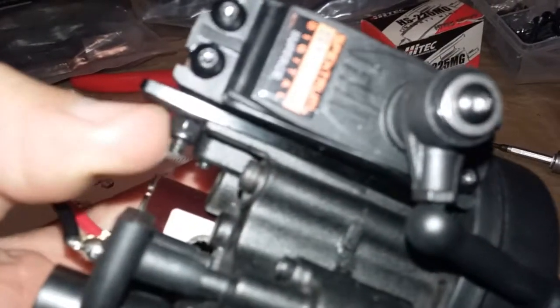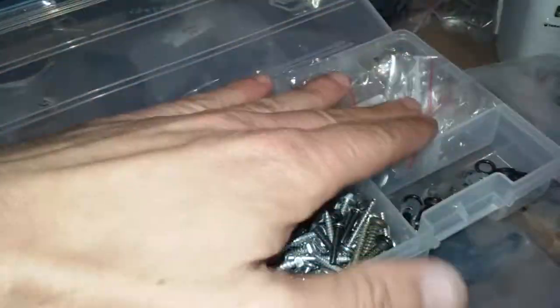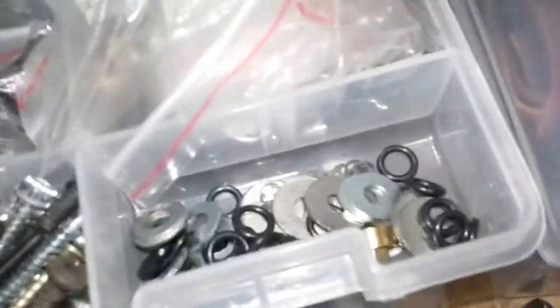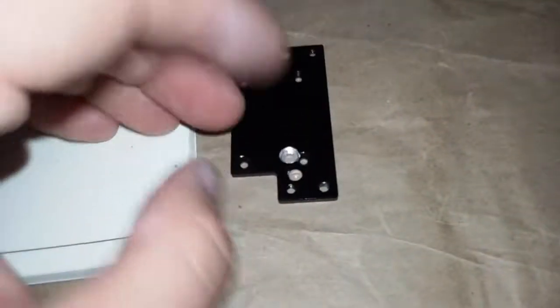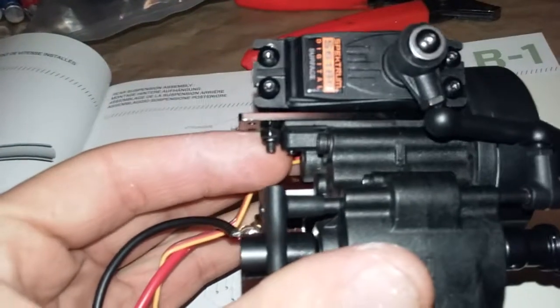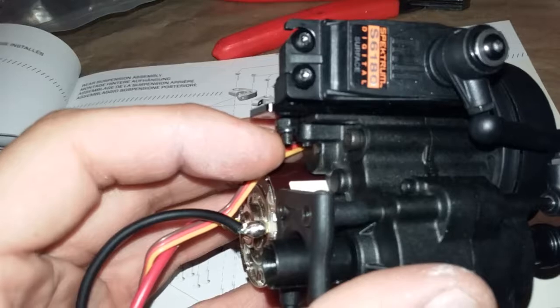I had to mark and drill a new hole and chamfer it on the underside right here. I used a little countersunk screw left over from my Trail Finder - they were nice enough to give you a whole bunch of extra screws. Everything is TF2 parts or screws. I put a tapered screw into that, screwed it back down to the factory mount, and then drilled out another hole over here and put in a long screw with a lock nut on the back half.